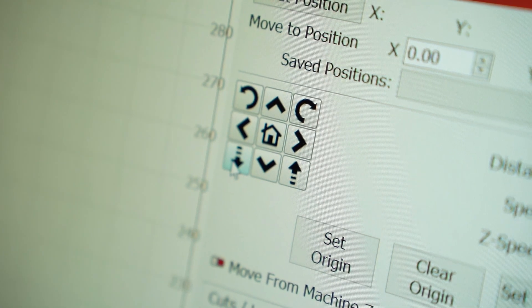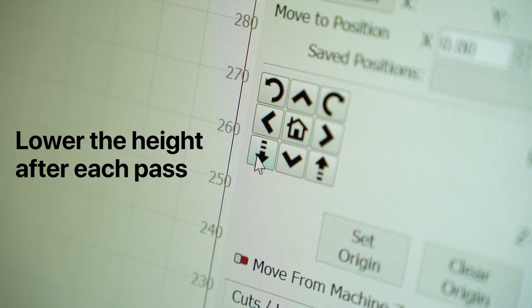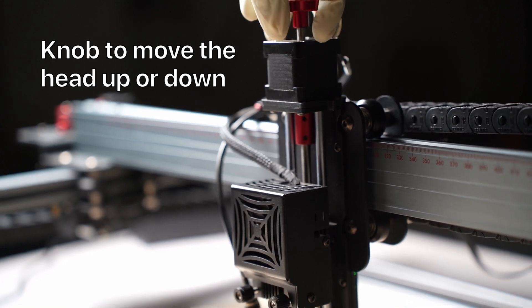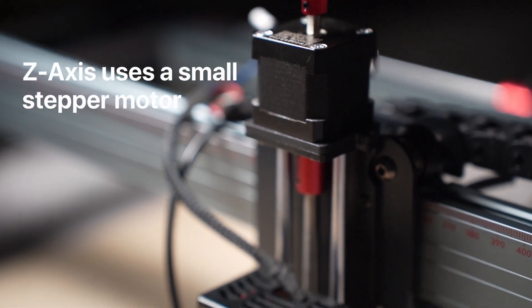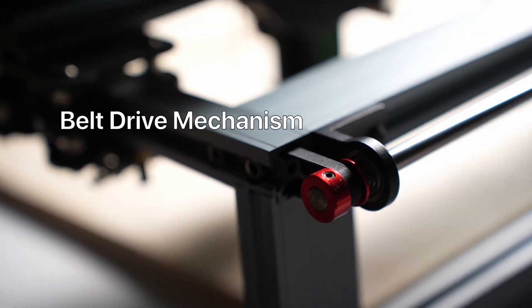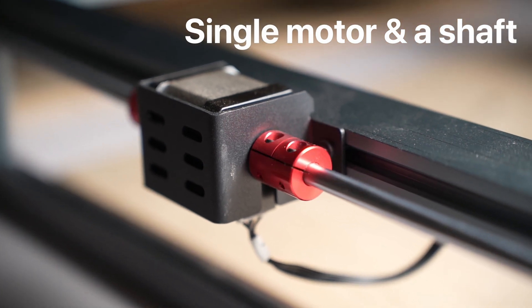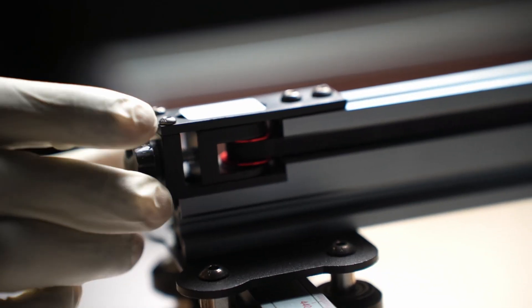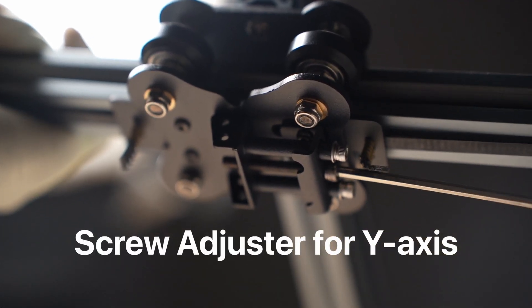The Z axis is motorized and really helps when cutting materials. You can lower the Z axis from the software to focus at the middle of the workpiece, or lower the height after each pass so the laser is always in focus no matter the depth. You also have a knob on the Z axis for moving the head up or down, and the Z axis uses a small stepper motor paired with a lead screw drive. On the X and Y axis, the TS2 uses NEMA 17 steppers and a belt drive. The Y axis uses a single motor and a shaft to drive both sides, preventing racking and keeping both sides in sync. Belt tension is adjusted via an easy-to-use knob for the X axis and a screw adjuster under the gantry plate for the Y axis.